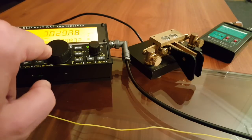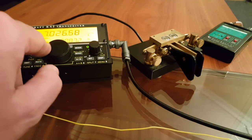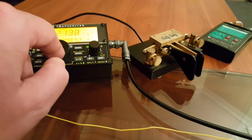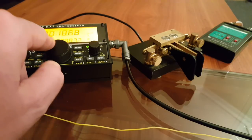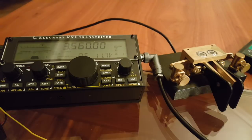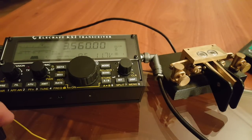It's better to have a horizontal wire in a city because most noise is vertically polarized. With such a short wire I would be much better off on 20 meters, but it's about midnight and I'm trying 40 meters right now and not hearing anything. I heard a little code on 80 meters but with a six-meter wire as an antenna on 80 meters — I don't think it's going to work. I'll sound a couple calls on 3560, you never know, although a 19-foot antenna when it should be 132 feet is not ideal.